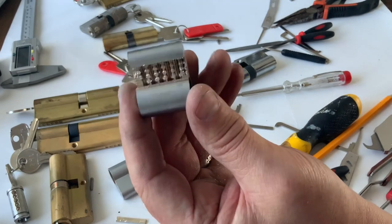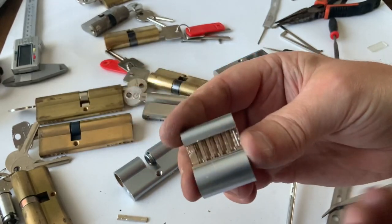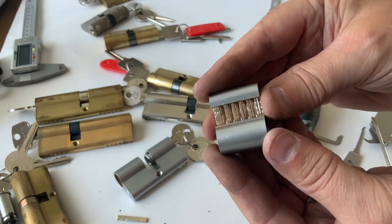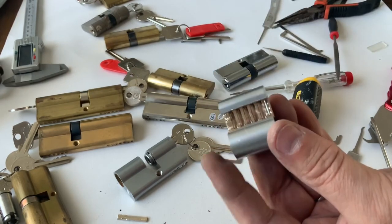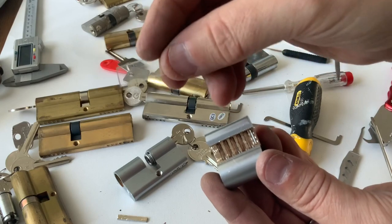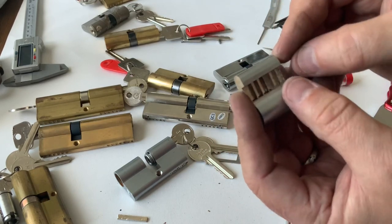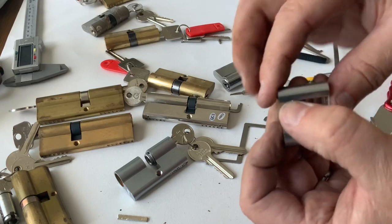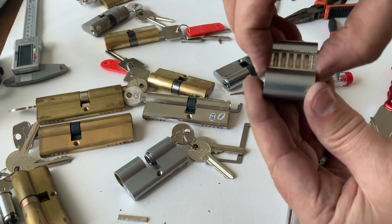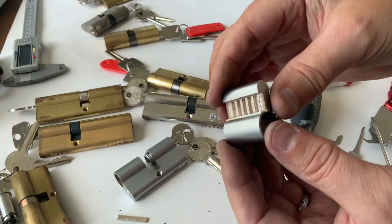I've cleaned it up - it's not perfect but it will do. A little tip: if you go too deep in the chambers and a little bit too wide, the springs can pop out. On this particular one I have gone too deep, so get a little bit of perspex - or if you haven't got perspex, an old CD case works just the same. Cut it to size, push it on so it's tight, and when you put your pins in they won't flip out. You can also put a little bit of super glue at each end to keep it in place.